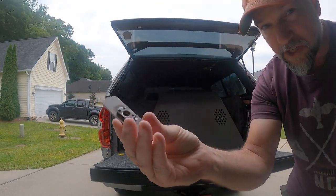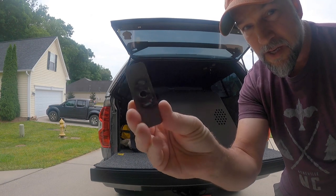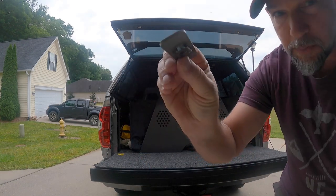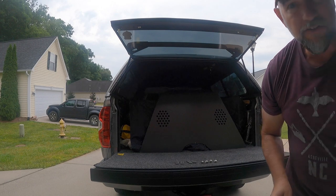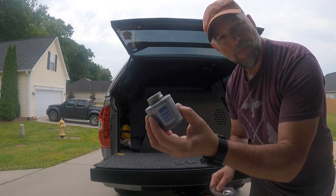For hardware, we have four of these brackets that go up into the frame and hang down, then you put one of these security bolts up through it. I've got some anti-seize — always put that on stainless bolts, otherwise you won't be able to get them off later.